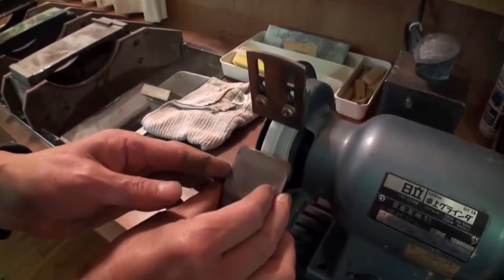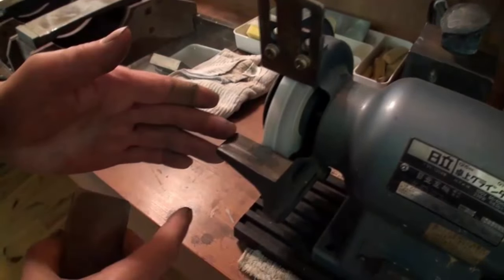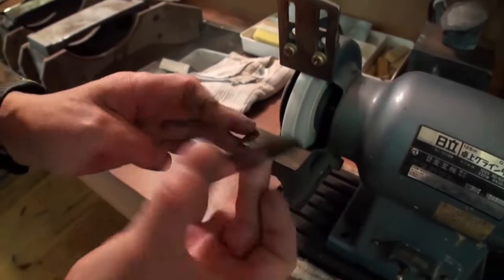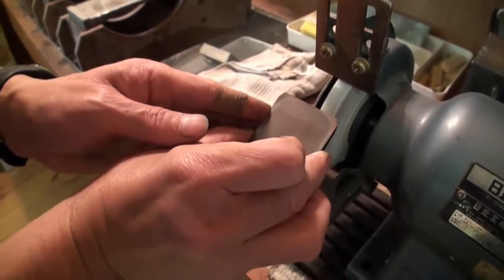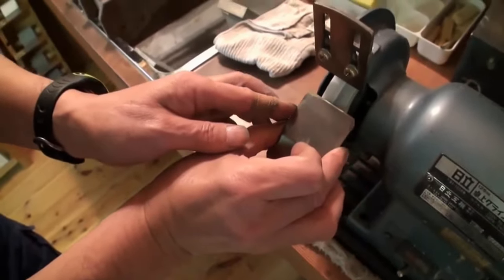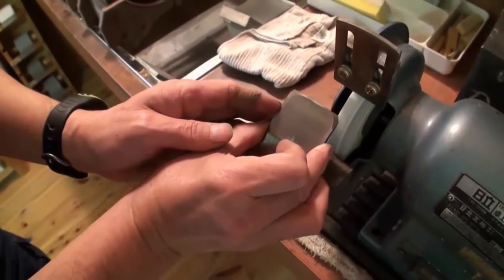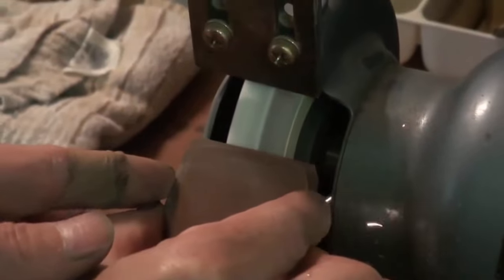Today, with the continuous development and upgrading of grinders, the job of sharpening blades has become much more effortless. You can easily buy most new plane blades, chisel blades, and so on from the store ready to use. If the cutting edge of the blade is not finished when purchased or has been badly chipped, just carefully smooth the backside first, and then start the sharpening process with the grinder.